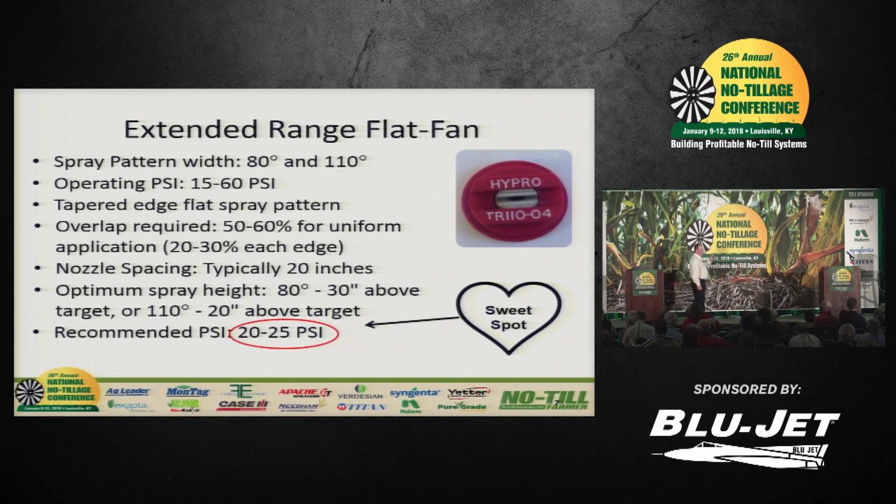So the manufacturer says 15 to 60, fine. That means it works there. To me, the minimum pressure of 15 is just as critical as the upper pressure, because if you do not observe the minimum pressure, your pattern won't be open. Below that, it drops. And if you've ever run a sprayer where the pressure dropped on that system for some reason, below that nozzle's rated low pressure, what happened to it? Pattern went down and maybe shut off. Didn't spray. Okay, so I'm calling it 20 to 25. That nozzle can be very successful there, and at that pressure, it's going to have a lower drift potential.